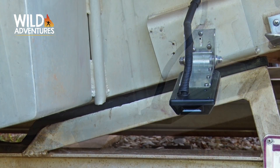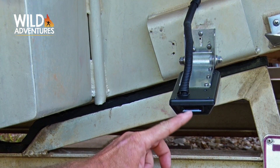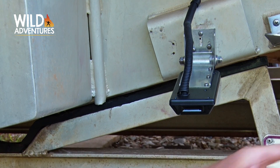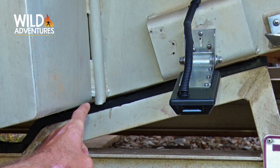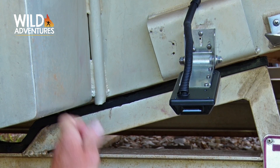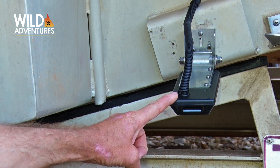In this case, having one transducer on the back of the vessel would be fine shooting a signal off to the starboard side, but the signal that shoots to the port will reflect and also hit the pod, creating a blind spot out to the port side. So you're going to be extremely limited in your side imaging capability, and that's not good enough.